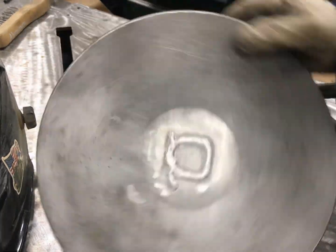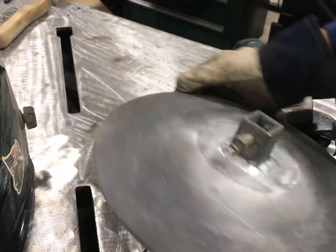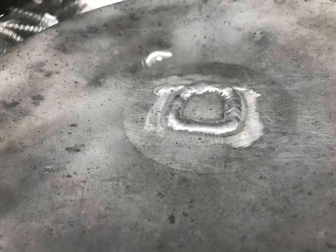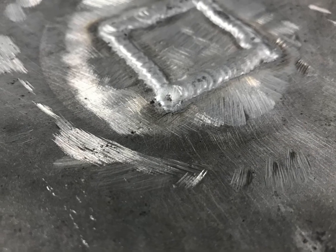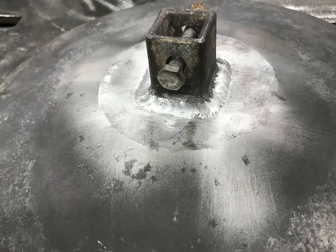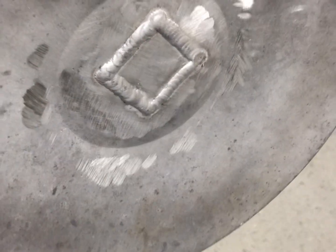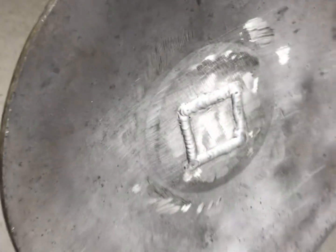My next step is once I have all of that welded, I'm going to grind it down to flush and look to see if I found all of the cracks. What I really did is mixed the base metal with the 4043 aluminum, then once I ground it down I had a base that was a mixture and re-welded it — and it came out a lot cleaner and nicer. I did not do that on the top; I just left that. It doesn't look that pretty in the pictures but it turned out fine. You're going to bring the junk right out of that casting, but overall it's a quick, easy 10-minute repair. Don't fear this stuff — give it a shot, it's not all that bad.